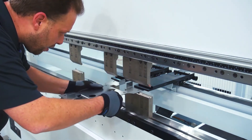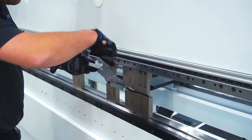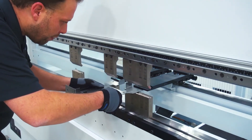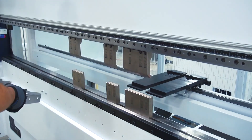Now these go in between, and this is where I have a little bit of a box bend, so I've got to be paying attention to how I bring the ram down. You can see my flanges go right in between the tools there. I'm going to run the ram down close and eyeball it carefully to make sure my box flanges go in between the tool stations.